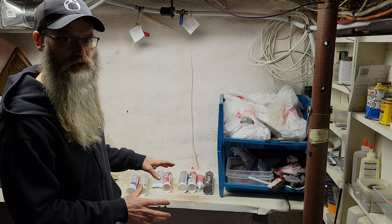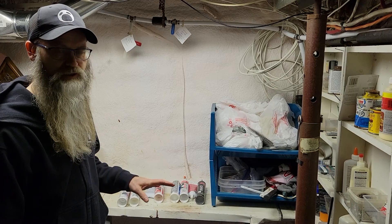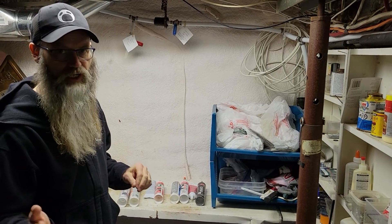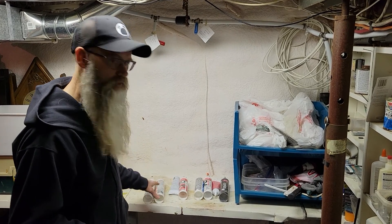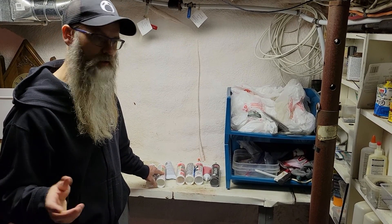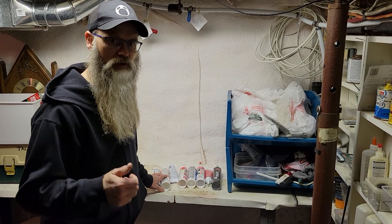Those are my tips for choosing the right caulking for the job — whether it's caulking or silicone. There are tons of products out there, but make sure you get the right product for the right application. If you don't, you'll have to cut it all off and start over. If you need to paint over silicone, you can use a Zinsser primer and sometimes bond an acrylic or latex paint over it, but that's another step. Any questions, shoot me a message, comment below, and subscribe. A home is a living, breathing thing, so you've got to look after it — thanks very much, take care!